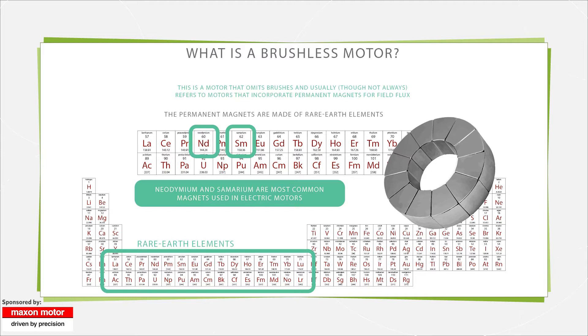The other two magnet types in brushless motors are rare earth types. More specifically, samarium cobalt magnets excel in hot applications, even to 550 degrees Celsius. The third option is neodymium magnets, which find use in industrial brushless motors as well as motors in electric cars. Low coercivity neodymium magnets can lose strength above 80 degrees Celsius, but some variants survive to 220 degrees. One drawback is that neodymium magnets can corrode and crumble, so they are usually treated with a protective coating — nickel plating or two-layered copper nickel plating is common.